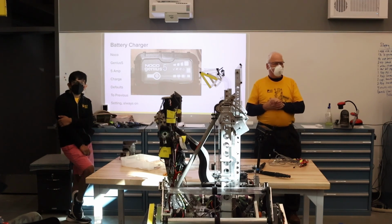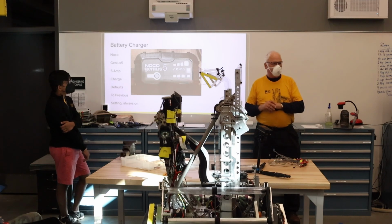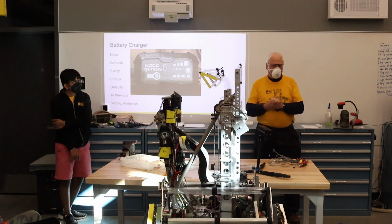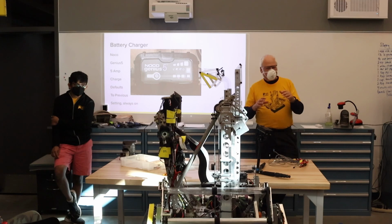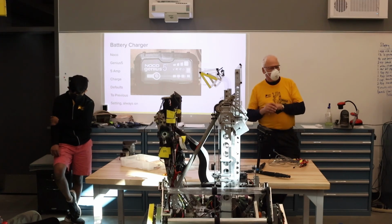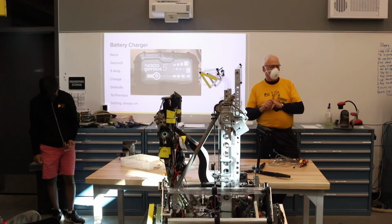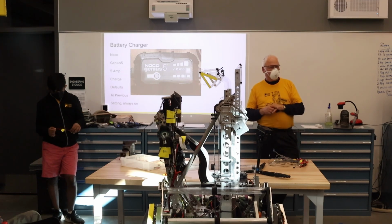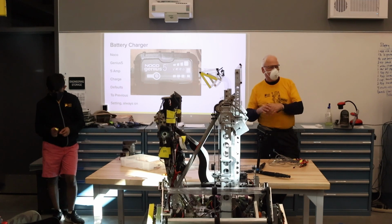Now, because we have battery cables and contactors, we don't get the 12 milliohms that the datasheet shows. We never measure that. But typically we'll get around 16, 17 or so. And it's a funny number anyway, because as you discharge the battery, the voltage is going down. So you can't truly call it the series resistance, because I'm taking all this data and doing a linear regression extrapolation, and I'm fighting what else is happening with the battery. But it's useful to compare batteries, and the point here is let's keep 20 batteries, as we have 2 battery carts that can do 9 batteries each, and retire the ones that aren't as good as the rest.